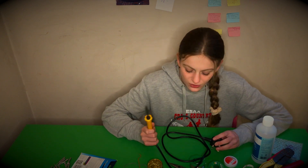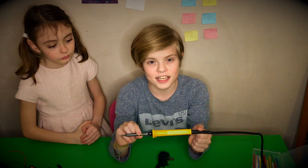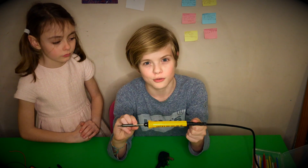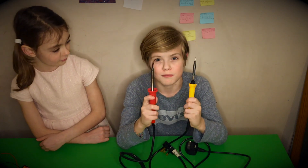Let's have a brief look at our soldering equipment. All in all ours totals to a little bit over 30 pounds, which is about 40 dollars. For your soldering iron, ideally you want one with temperature control, or even better a soldering station, but that's way beyond our budget. I'm using an Antex XS25 — it's 25 watts — and I've got pretty good results with this one. I started out with a different iron I don't really know where it came from, but my results weren't too good, so your equipment does matter.